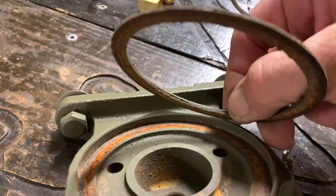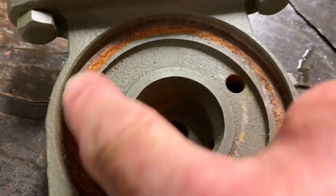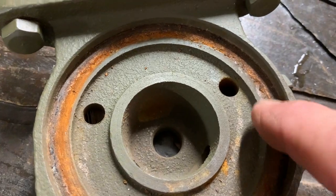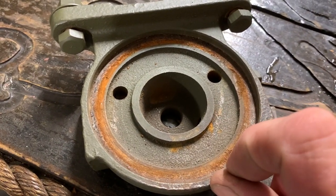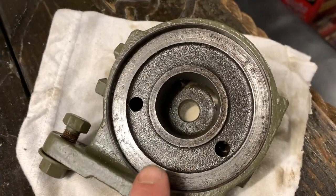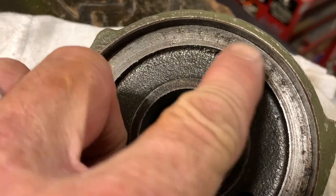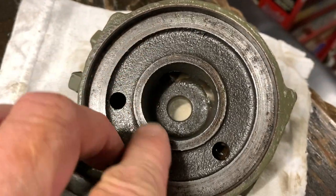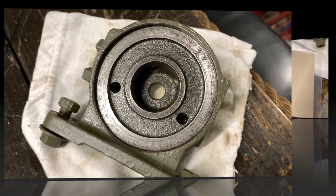Underneath you'll see where it's been sitting — it's all crusty and rusty. I'll take this outside and clean it up with the wire wheel and then we can proceed. Everything is all cleaned up now. You can see there's a little bit of pitting on the inside, nothing I'm concerned with — nothing that a new gasket won't seal up. I've also made sure the orifices were clean and blew those out with air, so everything is clean and ready to go.